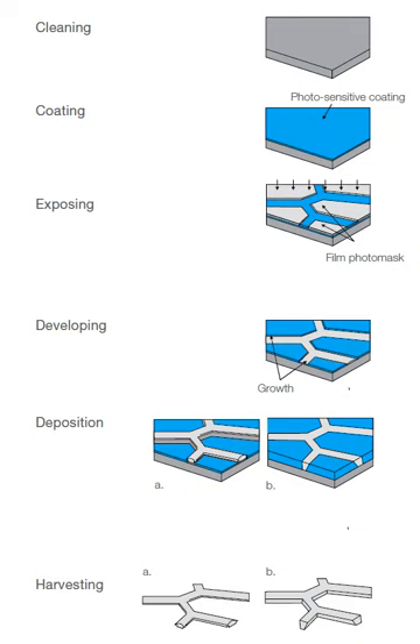The precision and resolution inherent in the photographically produced conductive pattern substrate allows finer geometries to be produced to tighter tolerances while maintaining superior edge definition with a near-optical finish. Electroformed metal is extremely pure, with superior properties over wrought metal due to its refined crystal structure. Multiple layers of electroformed metal can be molecularly bonded together, or to different substrate materials to produce complex structures with "grown-on" flanges and bosses.